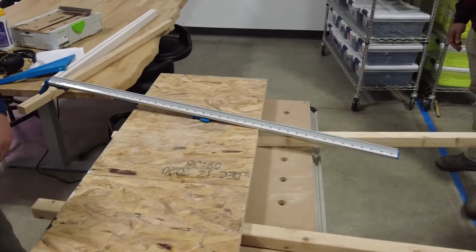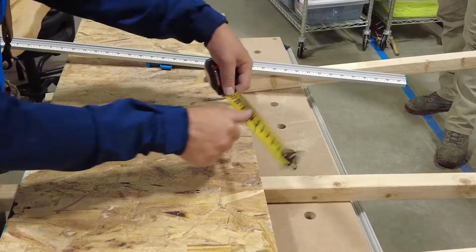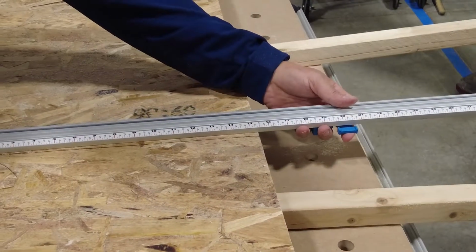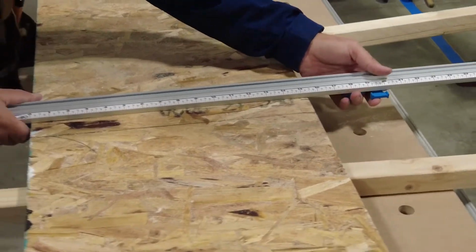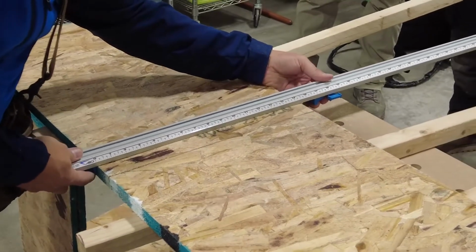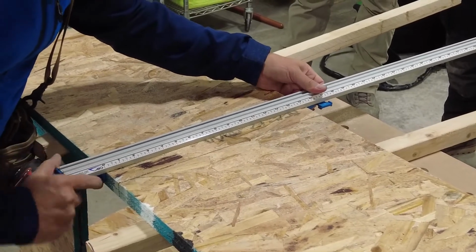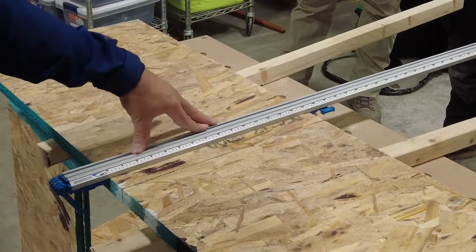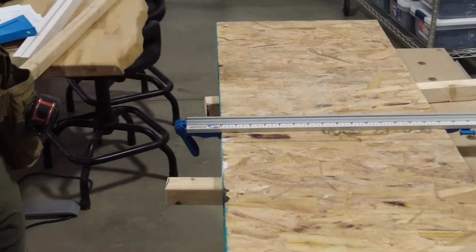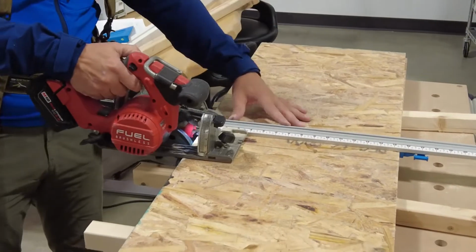Because the margin of error is a lot less if I do this versus if I try to measure from here, detail to detail. So I always want a solid reference point. Simple, okay. Put this on my reference point. What I was saying a minute ago about being hot and cold, the conditions aren't always ideal. So how do I make it so I can always be consistent in my markings? If I always use a table saw, a fence, a stop, something like that, I'm always going to be consistent, right? I don't bump it, and when I'm cold and my fingers don't work, it's safer.